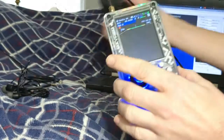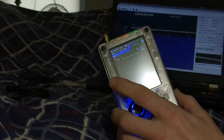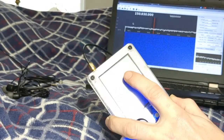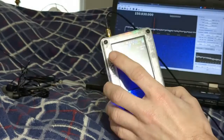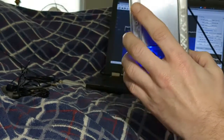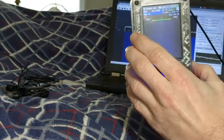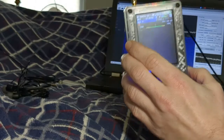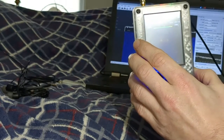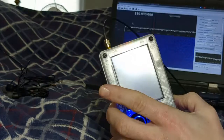If I take my Baofeng and transmit, make sure you turn down the power if you're transmitting in close vicinity. I've turned down the LNA and VGA and have the amp off. One shortcoming of the HackRF is that it's half-duplex, meaning it can only transmit or receive at once — not both simultaneously. But that actually makes it a perfect device to act as a walkie-talkie. I have the audio app open so we can take a look.